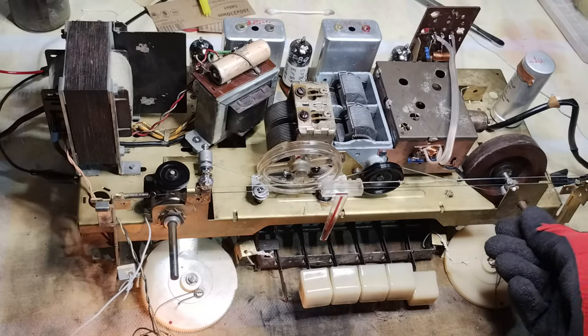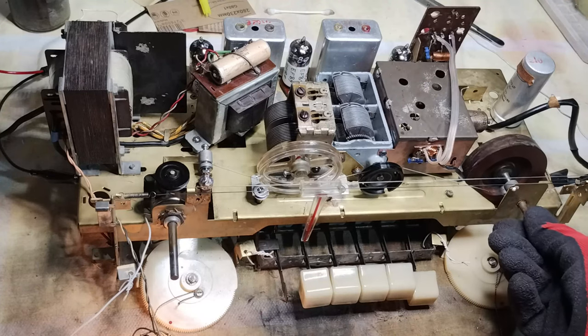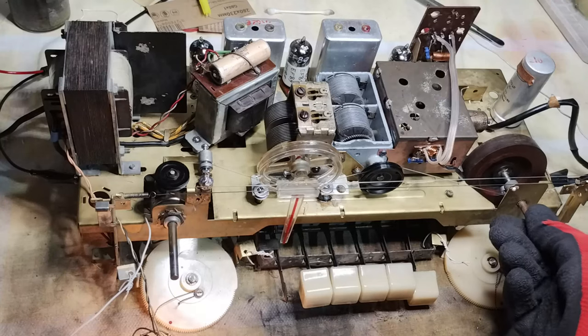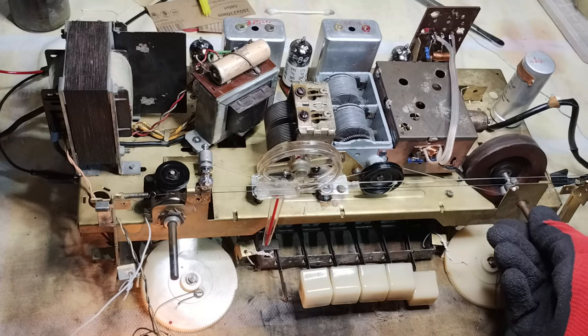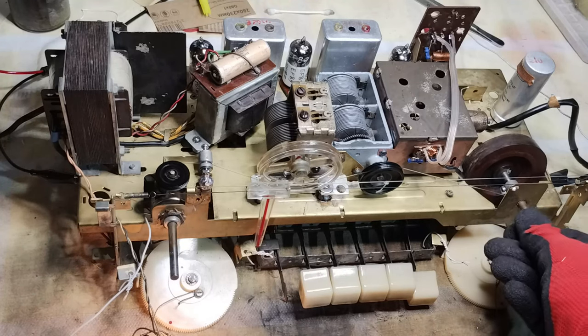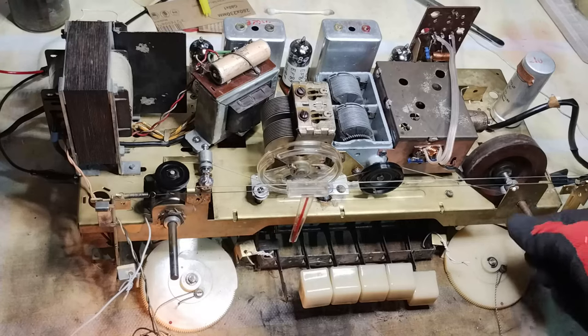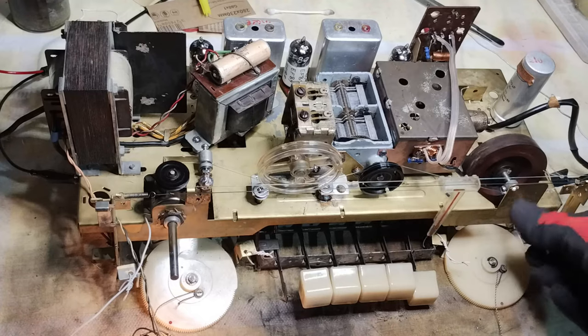In this test, it is clearly visible that the additional variable capacitor reaches the end of its rotation while the one used for the FM section has still one-third of its movement to complete. See the appendix for additional notes regarding the variable capacitor.